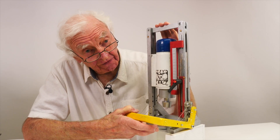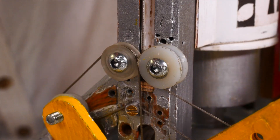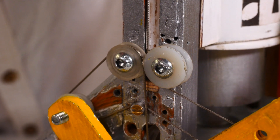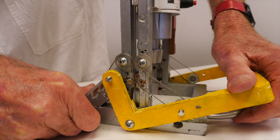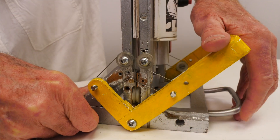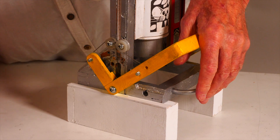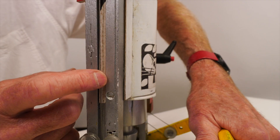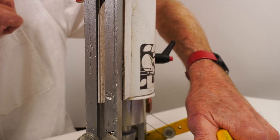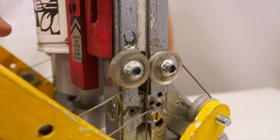And here she is, fully wired up. Now we're free to use the more subtle wire drive to control the rise and fall of the router. Grip the bars and up she goes, letting gravity bring it down under control. This single wire is in tension, equalized both either side and fore and aft. The pulleys give mechanical advantage.